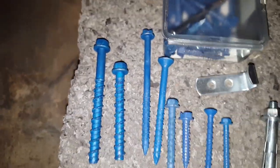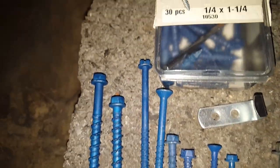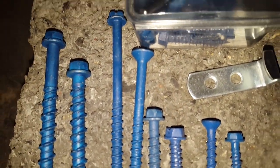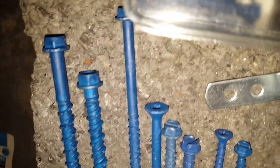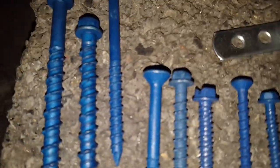If you're installing wood or something, you would use a longer screw, and then the threads are at the very bottom. The shank can be very long to allow for a larger piece of material. They have hex head screws with a washer, and then there's the countersunk flat one. It's important to make sure that you're drilling longer than the screws, and then blowing out the dust with some tool. The threads are only going to go into the masonry, and then it's going to hold the material just at the head.